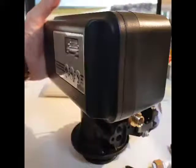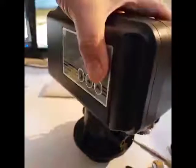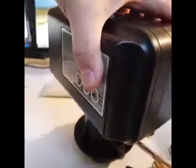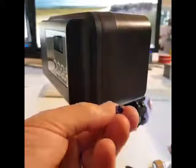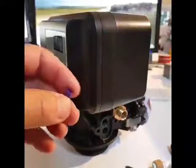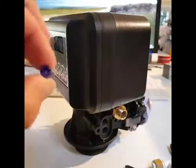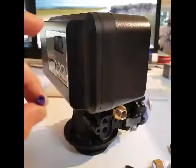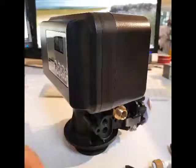Once we've done that, fiddle it out — you may have to put a needle in there in order to shake it out. And that's what it looks like. Again, it's got a hole through the middle of it — that needs to be clear in order for it to create the vacuum to draw the brine. So take these two purple parts, clean them out, and then put them back in again.